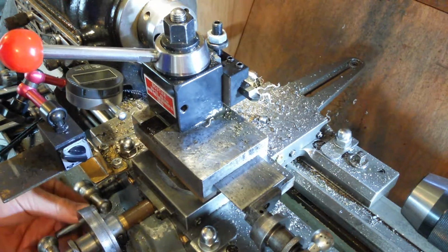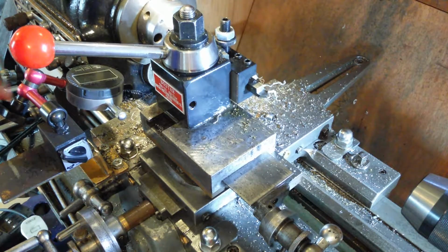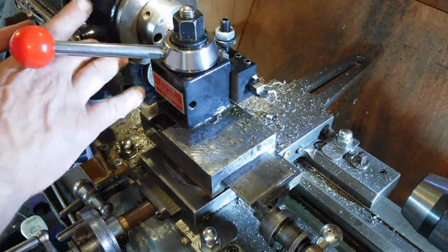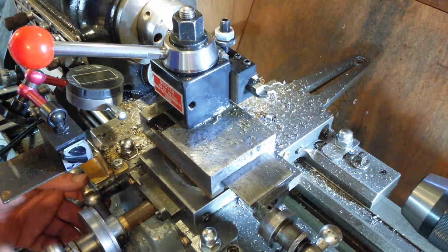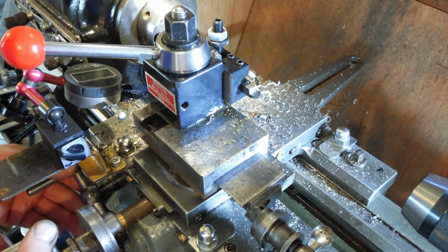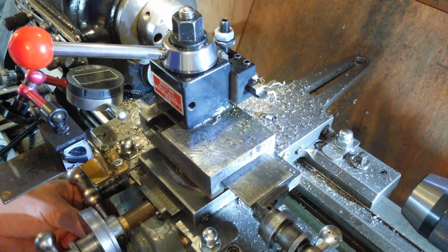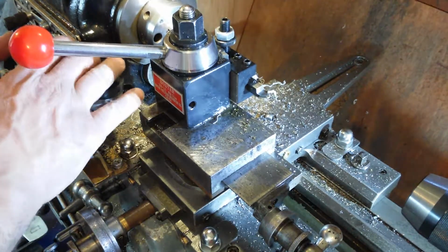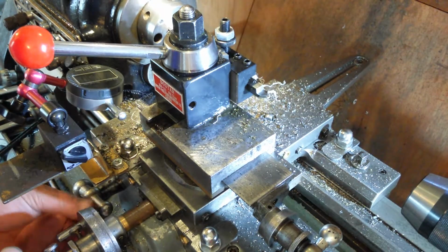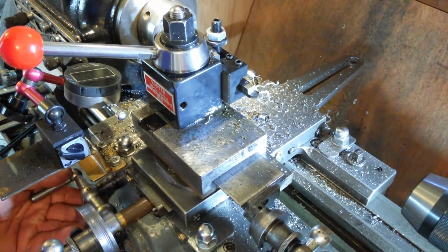Come out. I'm going to touch the face of the chuck. Turn that on, that should be at zero. Want it in millimetres. Come out a little bit, go in a little bit and go in 15 mil. Oh, good grief, let's just do all that again. In touch, that's zero, that's in inches. Millimetres, hooray! About there. And we want 15 millimetres. Have we got enough travel?